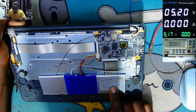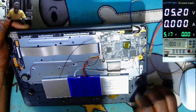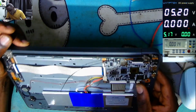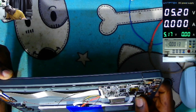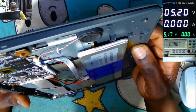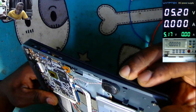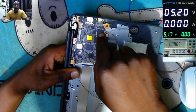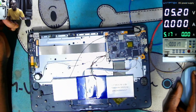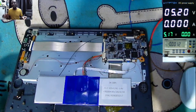On this one, when it's empty it should be around 3.8V; fully charged is 4.2V — just like a tablet battery. There's also a BGA chip here for storage. I'm not sure exactly which one it is, but it's easy to check on Google if you really want to know which one is the storage chip, because I've seen so many questions about that from the previous video.